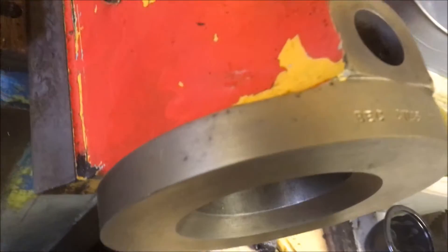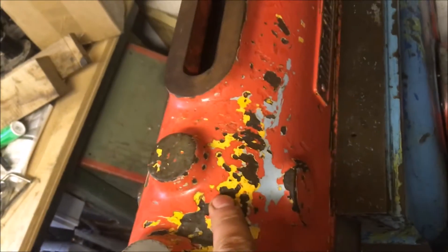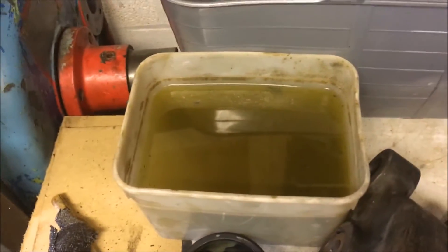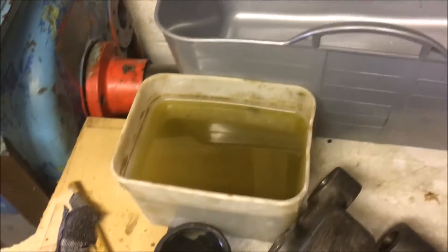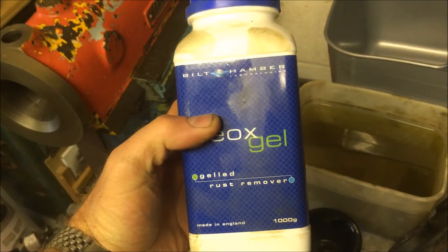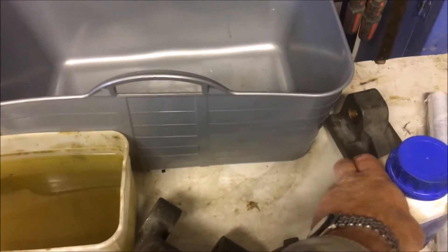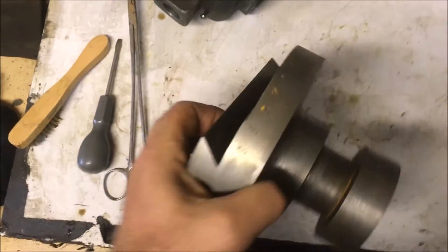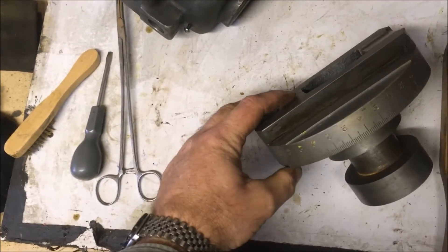It's the next morning. The various power outages yesterday meant I decided to do some stripping — clean off the rust using a rust eater, and then use the degreasing to take the grease off so I can put the water-based paint stripper on, and try that today. There are two types of rust eater: one's a powder you mix up at 14 to 1, you can go down to 19 to 1. The other one, same brand, is more of a gel you can brush on — it holds on a vertical surface. That's the tool head, which was red rusty all over.